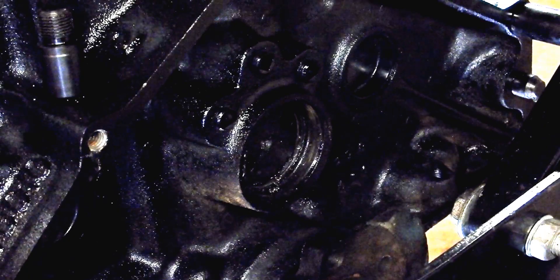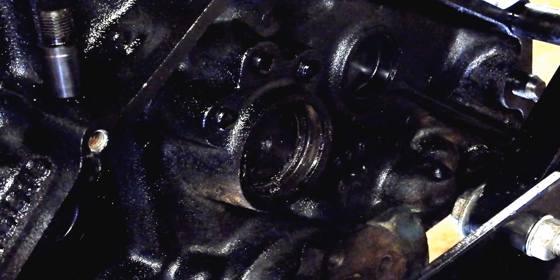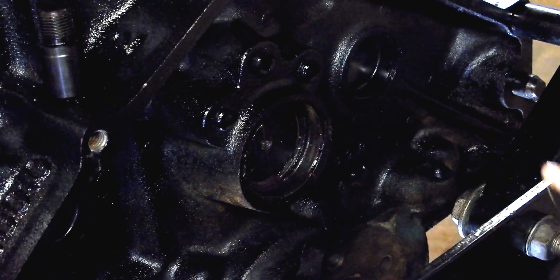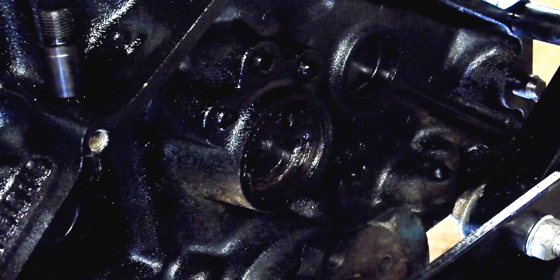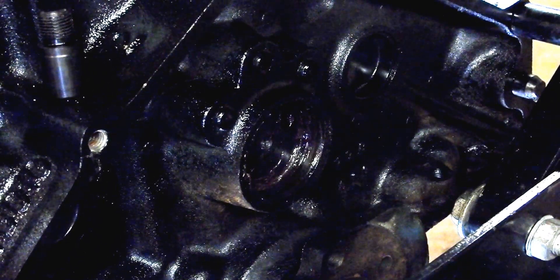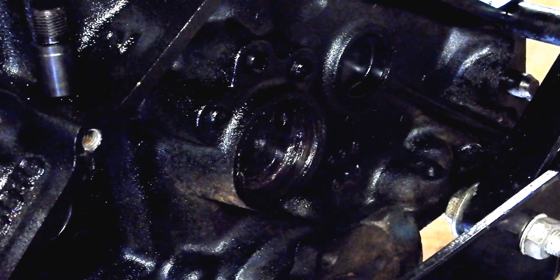You're not going to use that again anyway, just got to be careful you don't damage anything inside there when you're punching it. I'm going to put a little grease right around the edge of that cam just in case there are any shavings — they'll stick to this grease instead of getting in where the cam is. I'm going to start with a 3/16 inch bit.